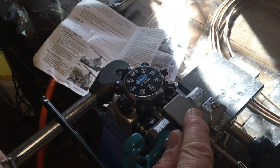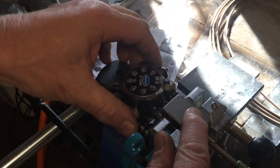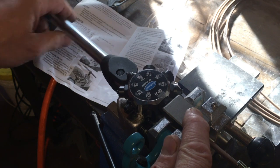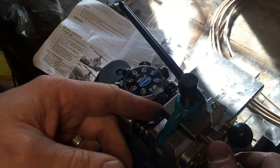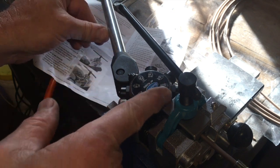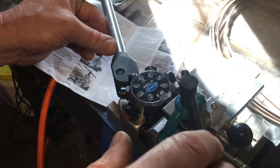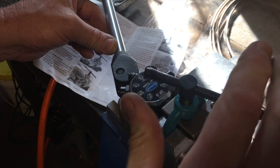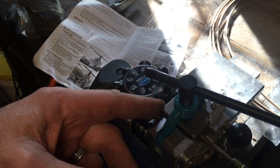I'm going to swing the camera around so we can see the business end of this thing. The lighting in our high-tech studio is brought to you by the good lord — I don't have any blinds in my shop. Going back through the instructions — we've done everything right. Brought the OP0 anvil up to the die, and the brake line is slid in until it touches, ensuring it's flush with the end of the die, then tighten the clamp down. They go into all kinds of gyrations to tell you how to put the pin in the hole, but it's pretty obvious — flip it over, put the pin in the hole, tighten the clamp down.